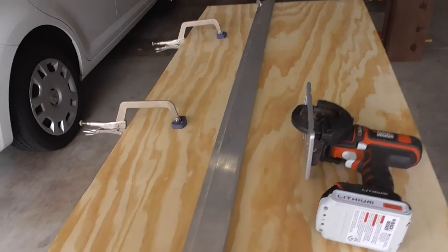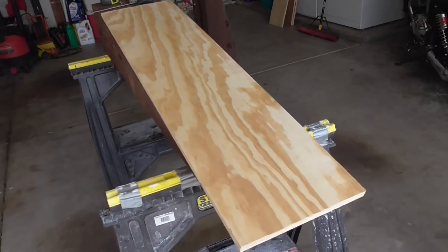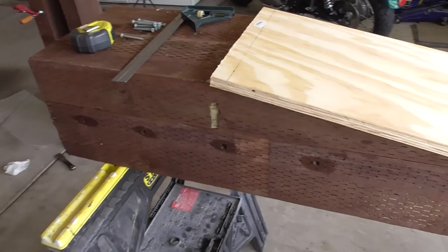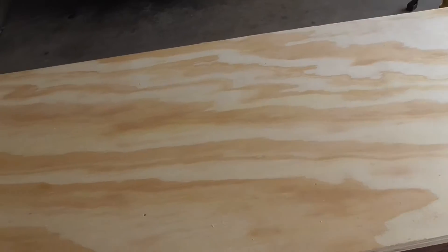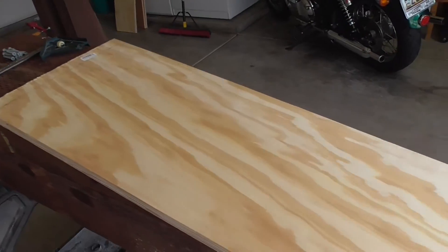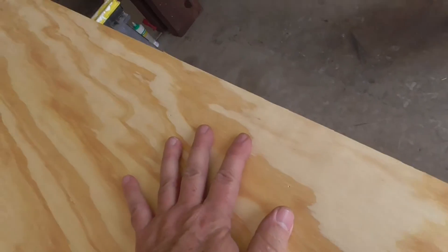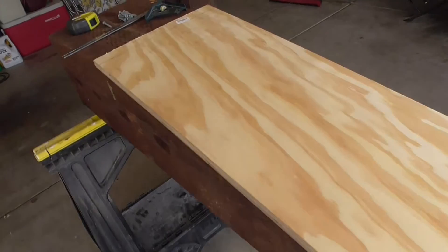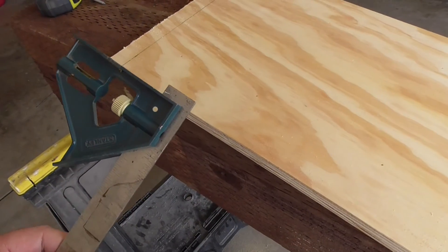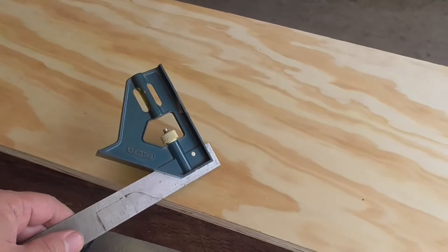This is the piece of plywood centered up on the ramp. I've got it up on the sawhorses to make it easier to work on. I've gone down and put center punch holes where I want to put all the screws, and I'm going to pre-drill this half because I'm going to get some glue on there — time will be short since it's supposed to get 8 minutes of working time. The wood is Home Depot wood so it's warped, so I'm going to drill the center and screw that bit down first. I'm using a set square, setting it out for an equal amount each side, and I'll put the first screw right in the middle.